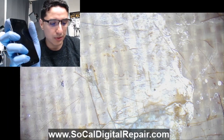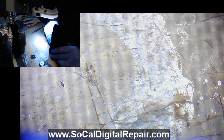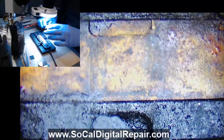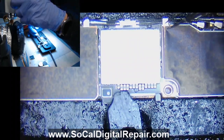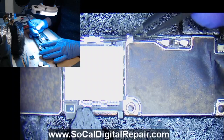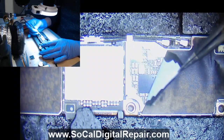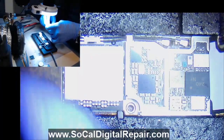So let's go through the process of replacing TriStar again. I'll take the board out and grab my preheater. I like to use the preheater because it makes it easy to peel off the sticker. I typically don't peel off the whole thing, I just peel off so much. TriStar is right here, and with the preheater it warms up enough so it peels right off. I go about this much and put a coin to hold it out of the way.